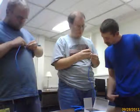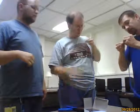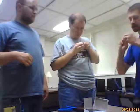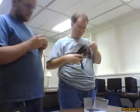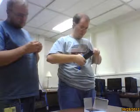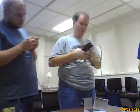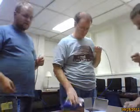Orange-white, orange, green-white, blue, blue-white, green, brown-white, brown. Yep. All the way there. And then work on that brown wire just a little bit, and your casing. Sometimes you just wiggle just a little bit and get your casing. Yep, the casing's up in it, and your wires are all the way in. Just double verify that they're in the right sequence. I think they are. White-orange, green-white, blue, blue-white, green, brown-white, brown. Yes, sir. I need to get my glasses.